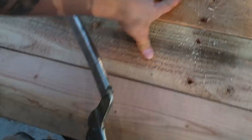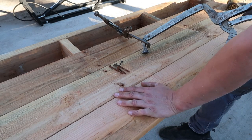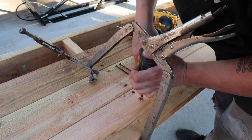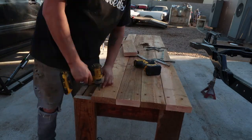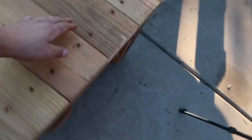I'm trying to keep this crack here completely closed - I don't want to be able to see through it. It worked great with the first two boards but my biggest clamp wasn't big enough to span across, so I doubled them up - whatever works. Using a combination of clamps I can see as I'm closing them it's shutting that gap. We ended up with a whole line of clamps to get this last board clamped down - but it's all good, got rid of all the gap, the top is nice and tight.